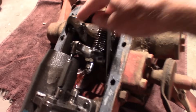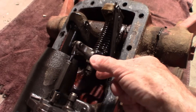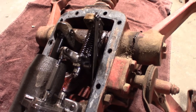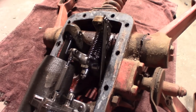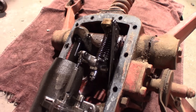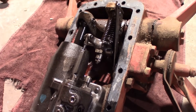What I'm going to do here is take this pin out so that this rod is loose, roll this unit over, take the bolts out that hold the cylinder in, so we can pull the piston out and change the seal on the piston and take a look at it. Once I get this pin out, get it rolled over, take the bolts off and get the cylinder unit off, I'll start filming again.